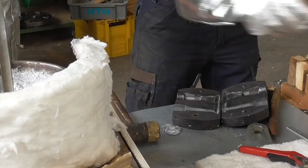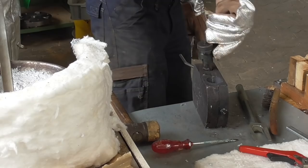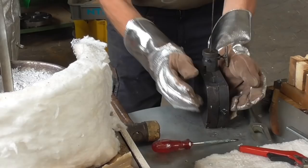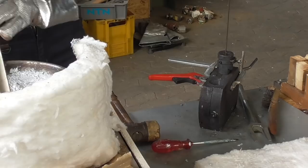First I have to put together the two halves and then insert the core with the stick. Then clamp together the mold, remove any new dross, and finally pour.